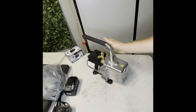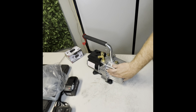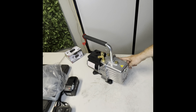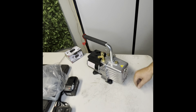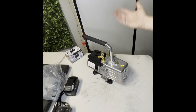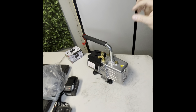Like I said, I already filled it up with oil, but it leaked out. These little faceplate bolts that seal this face gasket, every single one, I got at least two turns before I hit resistance. And this one, I got a turn and a half before I hit resistance. This one was two turns. The two bottom ones were two turns. This one was two turns. But I filled it up with oil, walked away, came back, and all the oil leaked out onto my tailgate. Kind of upset me a little bit. So JB, quality control, already not where I want it for an $1,100 pump.